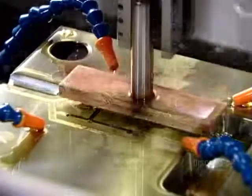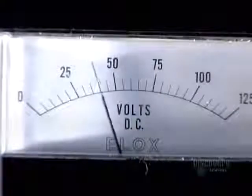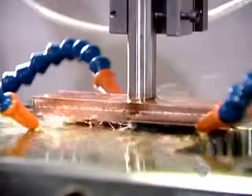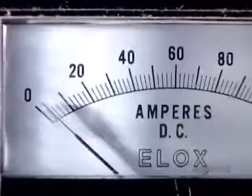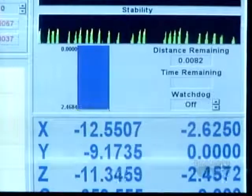The electrode goes face-down on the second tooling machine, called the EDM. Directly underneath is the mould half that's already been partially formed on the first machine. A strong electric current runs through the electrode and penetrates the mould, forming a cavity in the shape of the electrode.